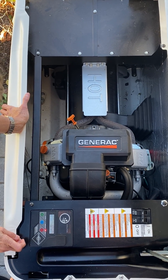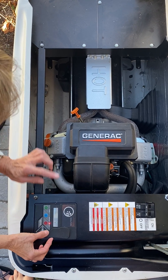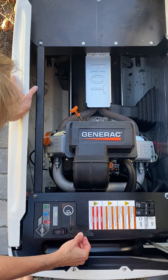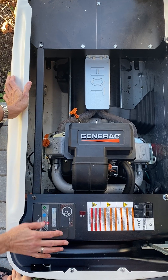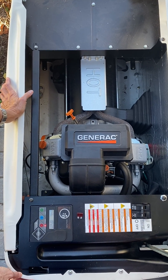What you want to do next, if this is going to be off for several hours, is you don't want this controller to drain your battery — which it does — so you want to go over here and take the 7.5 fuse and leave it out. Now you can leave your machine off for several hours to rest.